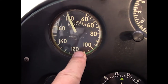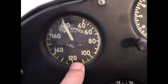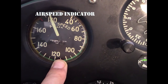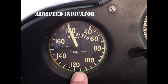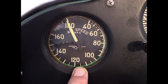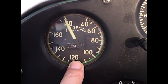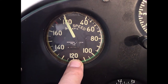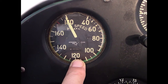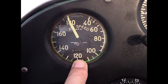The other flight instruments include the airspeed indicator, which is run by the pitot tube — it's air pressure created by the airplane moving through the air. This is subject to errors from the density of the air: as you get higher, the air becomes less dense and the airspeed indicator will read less speed. So you have to calculate your true airspeed using mathematical calculations, usually a chart in the owner's manual.